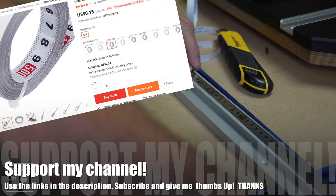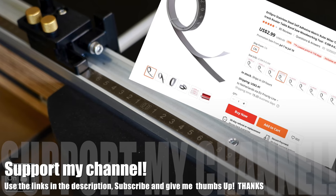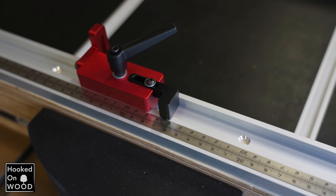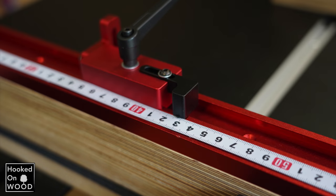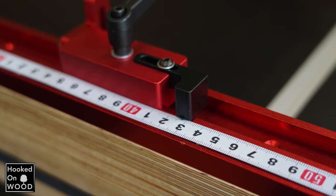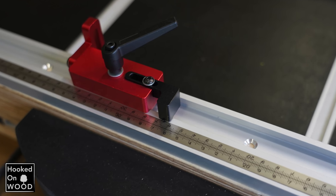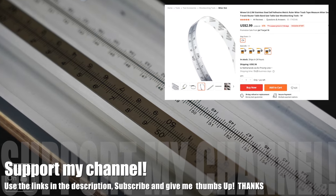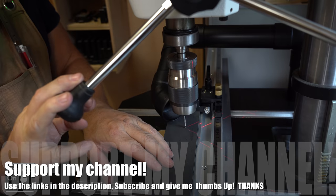I have a few different kinds of rulers. You can buy almost all these rulers with different scales, counting to the right or to the left, but also starting from the middle. And then you have different styles of rulers, like traditional ones or fancy aluminum ones. I like the traditional one on the red, for example — the traditional one is still the best to read. With some flip stops like the red one, you will see a tiny needle, and this is better to read on a white background. This ruler looks the same as the fixed ruler on the grey T-track, but the numbers are bigger and better to read. That is why there is always an advantage to buying a separate ruler that fits your style and flip stop best.